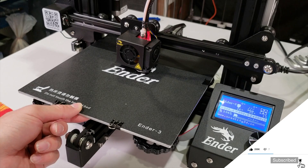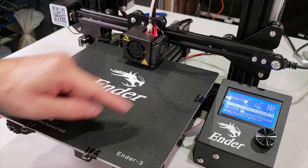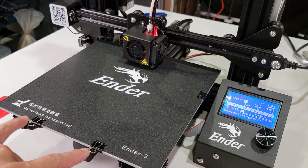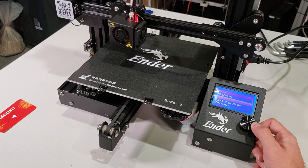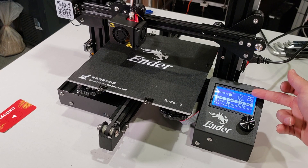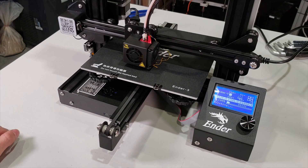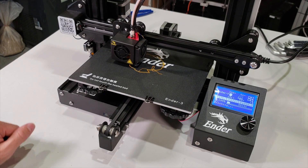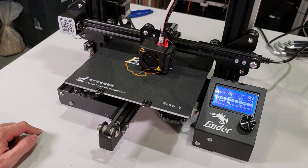I need to warn you about one more thing — these bed clips. Make sure that you put them in the correct orientation. With the handle, don't put a clip in the region where it will hit the bar. Put them to this side or that side. Let's start our very first print — I'll click the button and go to Print from SD and select the test dog G-code. My bed is heating up to 50 degrees Celsius and my extruder is going to heat up to 200 degrees Celsius, then the print will start. Congratulations — you assembled your Creality Ender 3 and started your very first print. If you have any questions or comments, put them down below, and don't forget to subscribe for new upcoming videos.